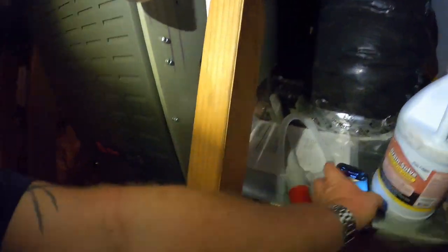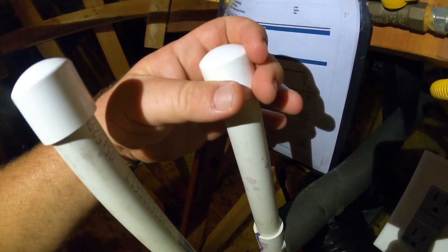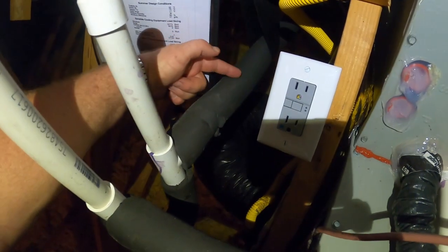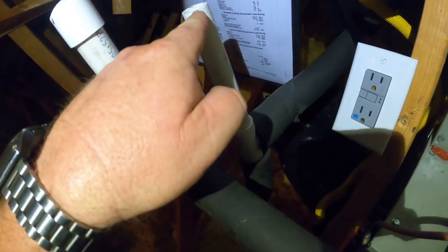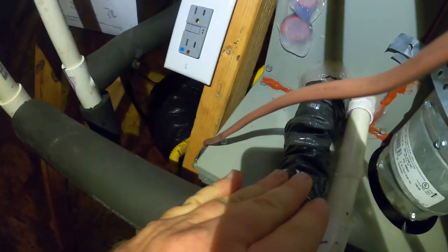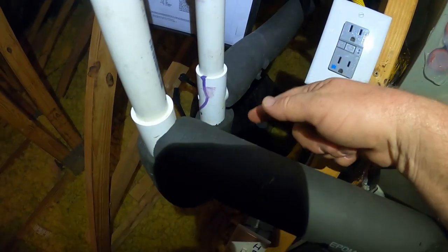We vacuumed out from outside. As I always tell everybody: if you're going to vacuum your drain line from outside, always make sure you put a cap on your vent and make sure there's a cap on your cleanout, so that you actually pull your vacuum all the way through the drain line, through the trap, all the way back to the coil. Because if you don't cap your vent, when you pull your vacuum from outside it's going to go straight through the vent and pull air in right there, and you're not going to pull any vacuum through your trap or drain line back to the coil.